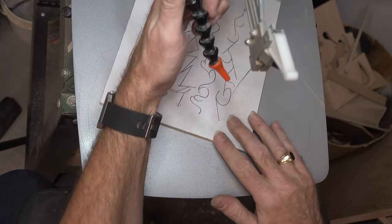Download some of these scrolling practice sheets. I don't know who made up this one — I found it online by Googling scrolling practice patterns or something like that. Use those patterns to practice your straight cuts, your curve cuts, your tight cornering, your tight 90-degree corners inside, outside, et cetera. It's a lot of fun. If you get those basic skills down pat — from setting up your saw, truing your blade at 90 degrees, getting the tension right, keeping your speed correct, and learning the fundamentals of feed rate versus rotation rate — there's no telling what you can do after that. There is no limit other than your imagination.